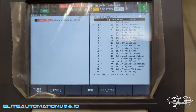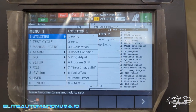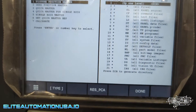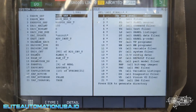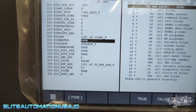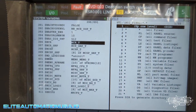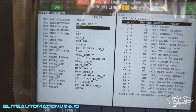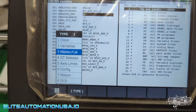If your Master Cal screen is not there, go to 06, then go to type variables and find dollar sign master enable — it looks like 'MAS' right there, Master Enable. You'll see a zero; if you don't see it, hit one and you should be good to go. Then when you hit type, the Master Cal screen will be there.